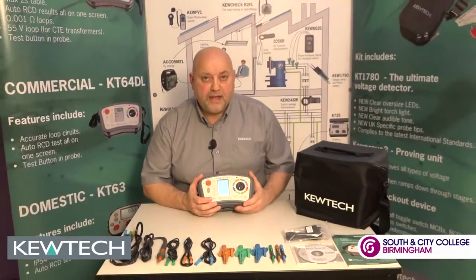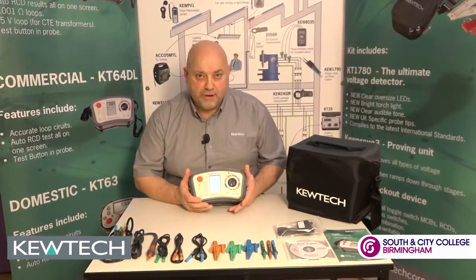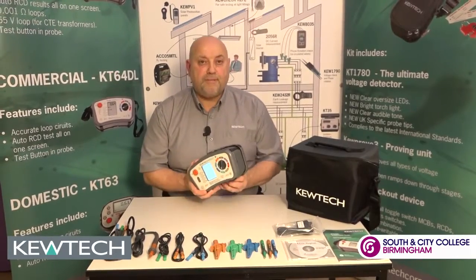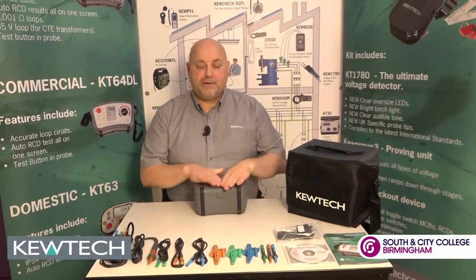If you're doing TT or lightning protection, out there you've got the earth rod under test. This three-wire tester will give you repeatable, accurate results. That covers all your testing. Finally when you're packing away, remember you've got the little lid protector — keeping your instruments protected.